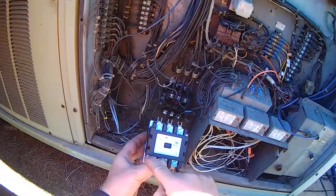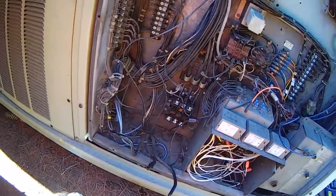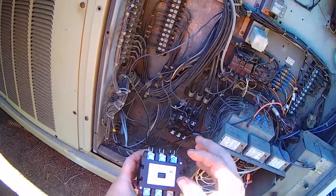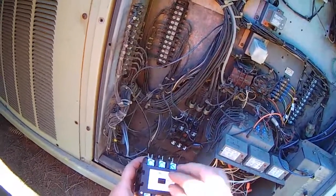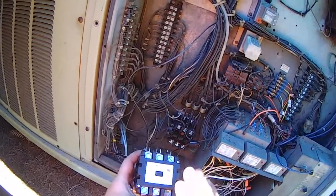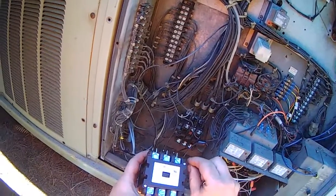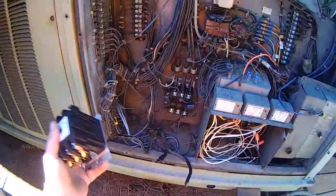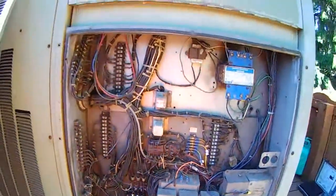What the contactor looked like originally — you notice there are two screws right here, that cover comes off and exposes the contacts. When you're looking at systems, you should always take a look at all the contactors because they'll arc every time they fire and eventually burn themselves out. If you see a tremendous amount of pitting, arcing, or carbon buildup, suggest to the customer to replace it.